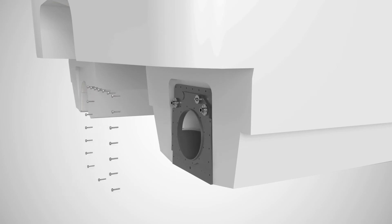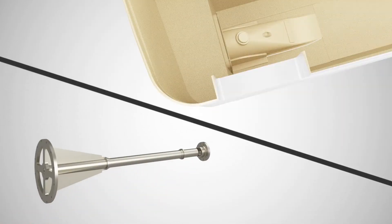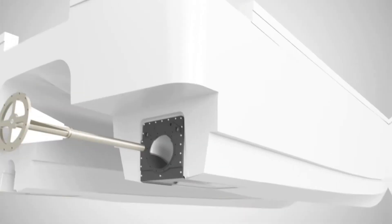The transition piece of the IWJ is simply bolted onto the transom and accurately locates into the moulded intake cavity. An alignment tool is supplied to provide an accurate shaft line reference for the yard to use to position and align the engine and gearbox.